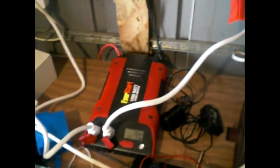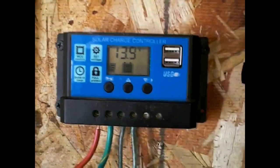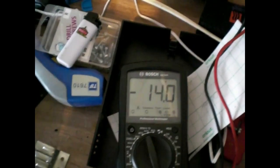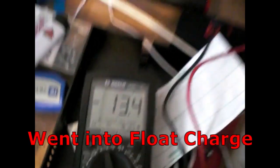I just turned it up to three, high, and it shut down. Maybe some of you guys can tell me what the hell the problem is out here. I know I've got plenty of juice right now — 13.8, and with it flashing it is indicating it is in bulk charge, 13.9, 14, 14.1. So I mean it's not too far off. What I'm not understanding is how a shop vac can run off of this inverter but yet this little fan cannot. Can anybody tell me what's going on? The only thing I can think of is maybe there's something internally wrong with the fan. I have another one in the house, let me go grab that.